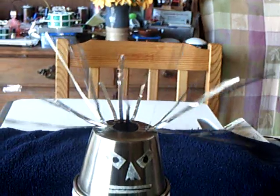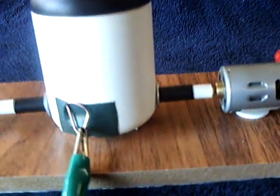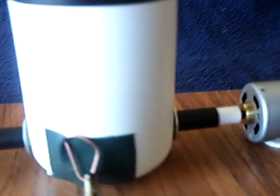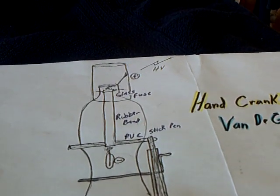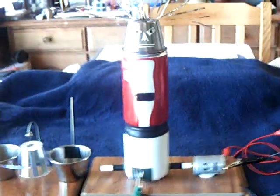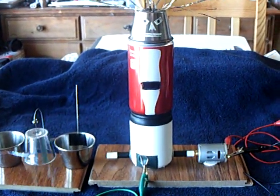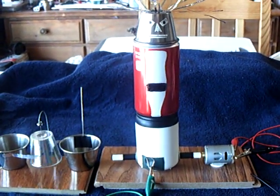Anyway, I thought that was pretty neat — that you could use such a simple structure and build up one of these Van de Graaff generators with just a motor stuck on the end of a pin, run through the bottom of a pill bottle, and make this powered Van de Graaff generator. That's just something I wanted to share: you can make these Van de Graaff generators out of some very simple elements and they're actually pretty darn potent. Thanks for watching.